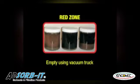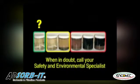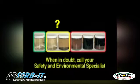If the water sample is more like the sample shown here, very cloudy with excessive amounts of sediment, rust, or oil, it is severely contaminated. Call your safety and environmental specialist or supervisor to dispatch a vacuum truck to the vault location. Finally, if you're in doubt about the level of contamination, contact your safety and environmental specialist.